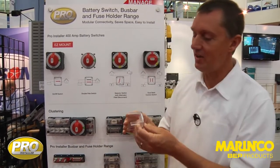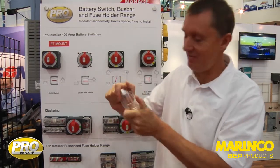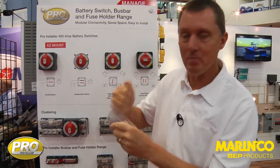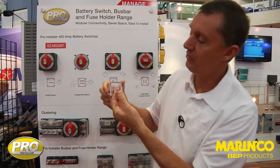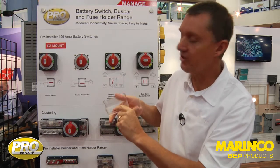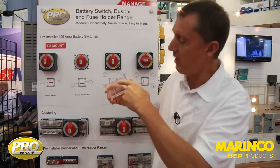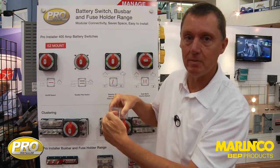The Z cover is a high quality polycarbonate cover. They are tough — they will stand impacts and hard use — and they have special breakout areas. By trimming with a box cutter knife, we can score once, twice, and then break those out if we need to bring extra cable access in.